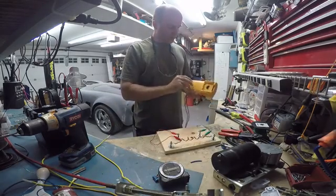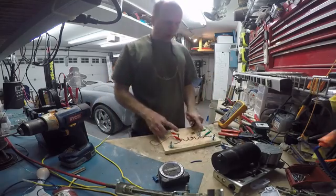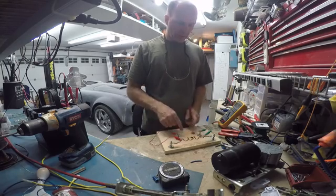That's at the millivolts. I'm measuring the voltage drop across this wire with the tiny resistance that's in here. Now I'm going to have to make some adjustments, but I have no idea how to do that — but once I get it where I want, then 1 millivolt on here will equal 1 amp running across this wire.